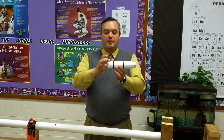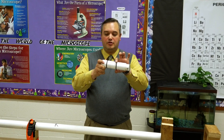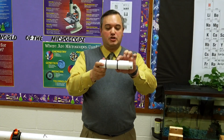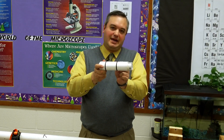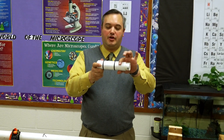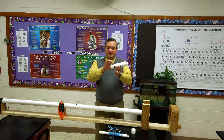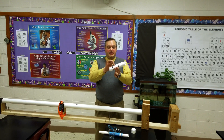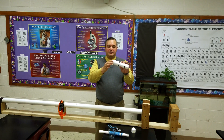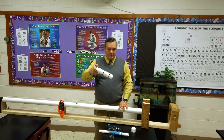You take an end cap and an O-ring, then a coupling — glue that in place so it squeezes up against the O-ring and makes a nice seal on either side. Put another piece of inch-and-a-quarter pipe inside, add another O-ring, then glue another piece of coupling on the back. So the design of the piston is: an inch-and-a-quarter end cap onto a piece of pipe, then an O-ring, a piece of coupling, another O-ring, a piece of coupling, and then a little piece at the back so you can attach something to pull the piston through the two-inch PVC pipe.